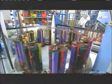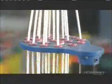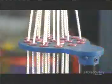They place 48 of these bobbins on the maypole machine, so called because the braiding action resembles a dance around a traditional maypole. The bobbins spin and zigzag around each other as a machine pulls core yarn up through the center. Here you can see the rope being braided around the core yarn as it's pulled up through a die.